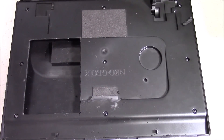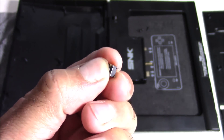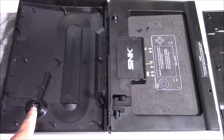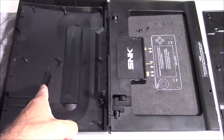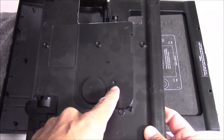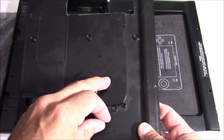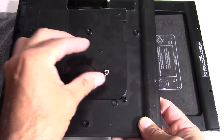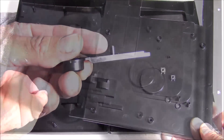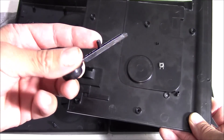This next step is optional, but if you want a functional power button accessible from outside the case, follow these instructions. I'll be using a tactile micro momentary push button switch, and I'll be using the reset button already built into this case. The reset button has a notch that pushes through a hole right here when pressed. You want to center the momentary switch directly on top of this hole, so when everything is put back together and you push the reset button, it contacts the momentary switch and acts as a power button.